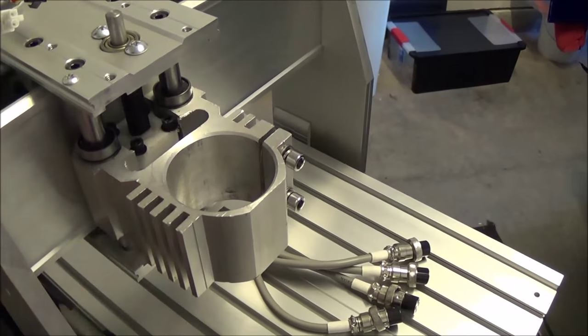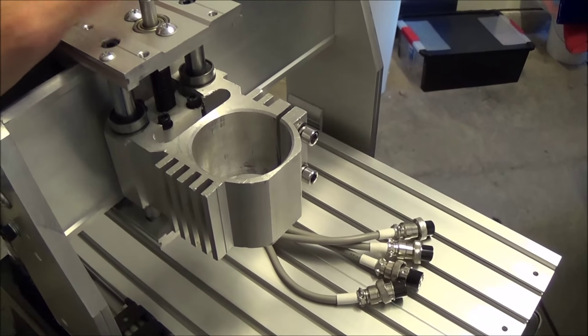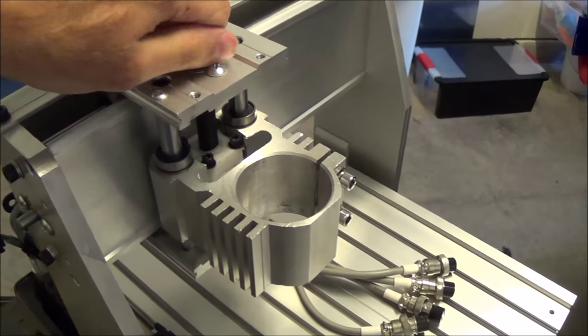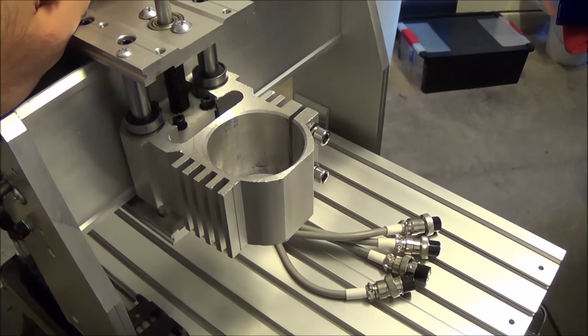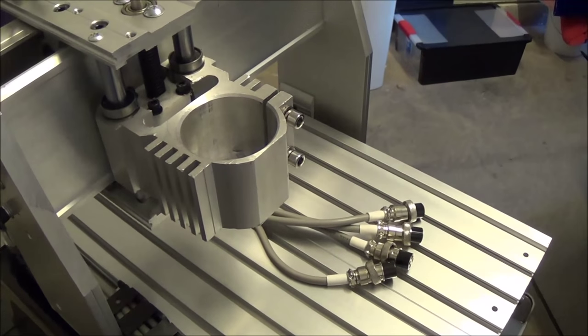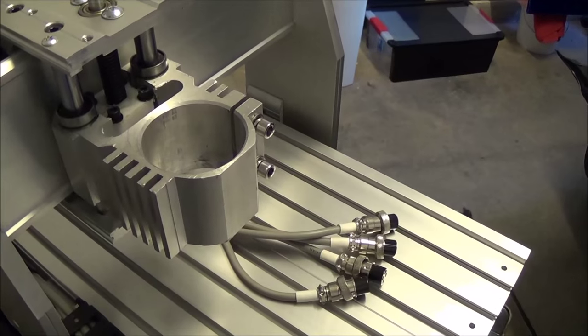I mean, it's pretty solid. When you're milling with it, I've done stainless, I've done titanium on them, and you just gotta know what you're doing and use as small bits as possible, highest RPM, keep your feeds up. And it eats through bits like there's no tomorrow. But you know, again, for the money, you really can't beat it. You really can't.